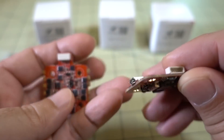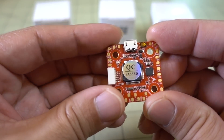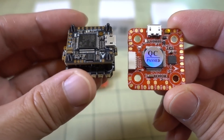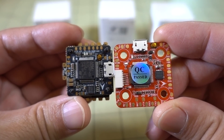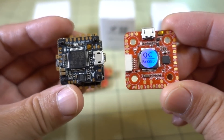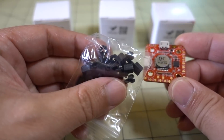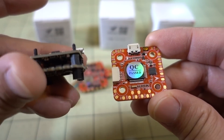Let's give you a closer look at the boards themselves — here's the ESC on the left and flight controller on the right. As you can notice, the boards are actually quite a bit bigger than the old boards, because first of all they use M3 holes instead of M2 holes. For size comparison, here's the old F428 stack — it's quite a bit smaller. The mounting hole pattern is 20 by 20, but the board itself, the flight controller, is about 30 by 30. So that's quite a bit bigger than the old boards, and with the nylon hardware included it's going to be a bigger stack overall.